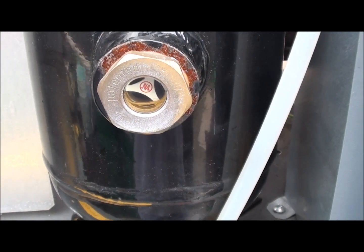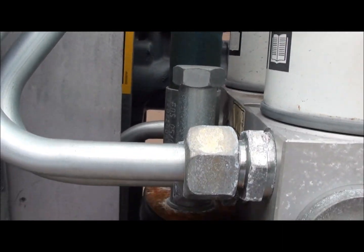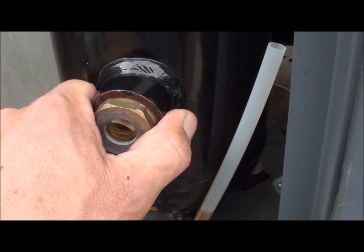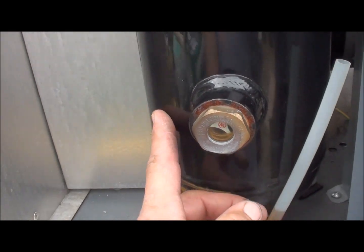If you see it's low on oil here — it should be up in the sight glass. I assume you fill it from over here, which is kind of crazy because you can overfill it. Most rotaries aren't like that; they typically have the fill point right where the sight glass is so you can't overfill it. But in this case, you certainly could.